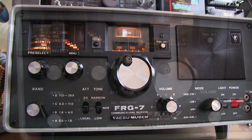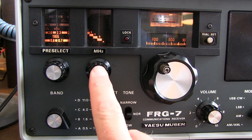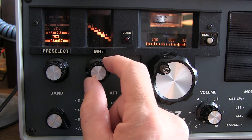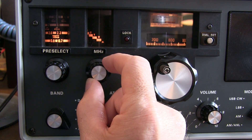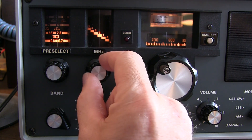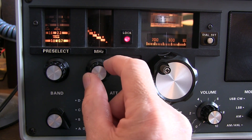We'll actually see that in action shortly. The process of tuning a desired frequency is to select the band, adjust the preselector to approximately the portion of the band you want, then adjust the megahertz knob. With the megahertz knob, you select the megahertz portion of the frequency — dial to 3 for something at 3-point-something MHz, or down to zero for the lower half of the AM broadcast band around 500 kHz to 1 MHz. Adjust until the lock light goes out, which tells you the second LO in the Wadley receiver is properly set up.